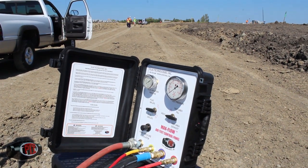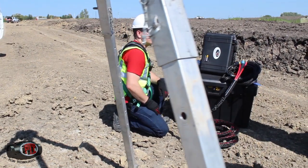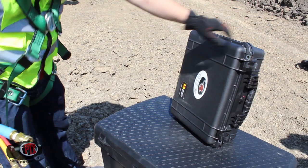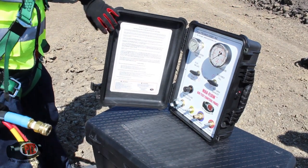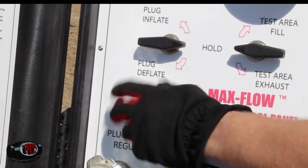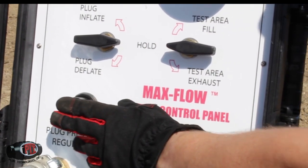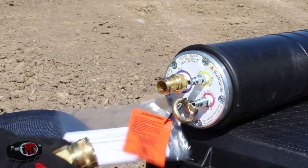In the front side or test side manhole, connect the 6-12-inch Fatboy Tester to the 50-foot triple hose and control panel. Ensure the control panel's plug inflation valve and test area valves are both in the closed hold position. Make sure the panel's plug inflation regulator is in the closed position, or turned counter-clockwise all the way to the left. Connect the triple hose to the plug.